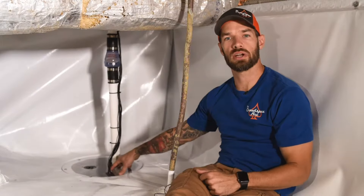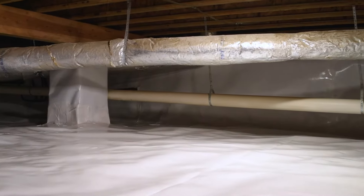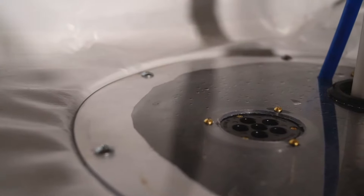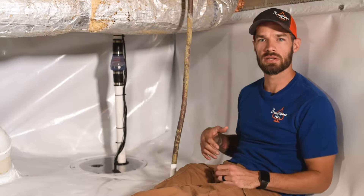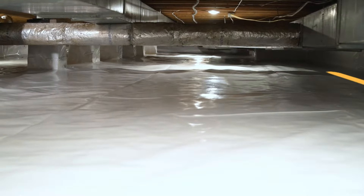The reason you need a drainer drain is if you have a plumbing leak and all that water lands on top of your liner, you can force that water over to the basin and it's going to seep through that drain and into the basin. The drainage system we installed in this crawl space forces any water that seeps in to this location and out through trenches that we dug throughout the perimeter of the crawl space.